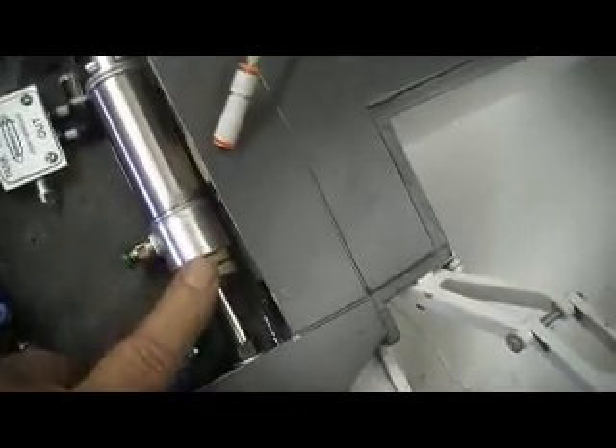Okay, here's what I got done. I got my hydraulic pump mounted and my cylinders in there. People have been asking about these cylinders from Surplus Centers. This is a single-acting cylinder — that means it has a spring inside. The spring pushes it out. Some have springs to push it in. Double-acting has air on both sides; single-acting has air on one side. This one is about an inch and an eighth diameter, and I got it for 20 bucks. I got my valve set up and my pump in there.